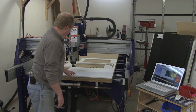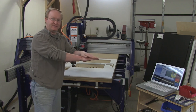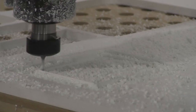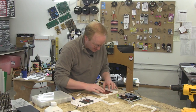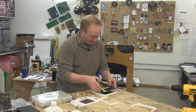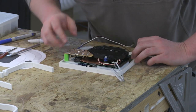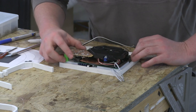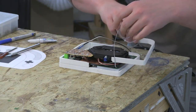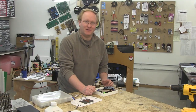I've drilled 1/16-inch pilot holes in the material and now I'm going to use a larger bit to clean out the major shapes. I'm making the bottom layer and the layer just above it to start. Here are the first pieces of the case. The aluminum heat sink goes there, then the Dreamcast sits on top like this. There's a countersink so the components fit, and then there are screw posts, a power switch, and power modules up here. These walls I made in two different pieces to save plastic. Once I know it's all going to fit together, I'll glue it.